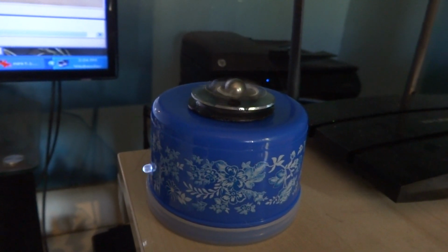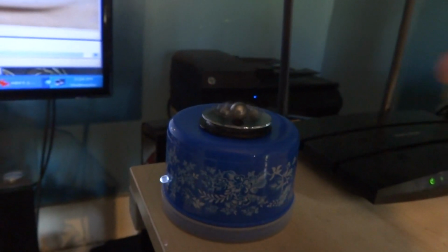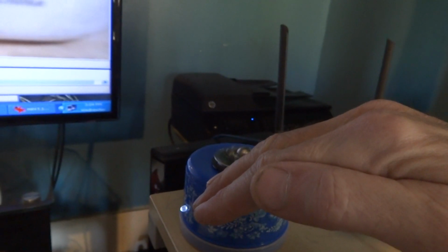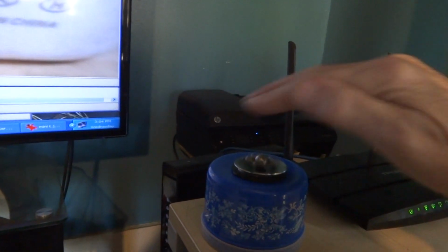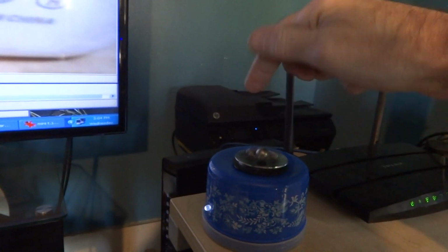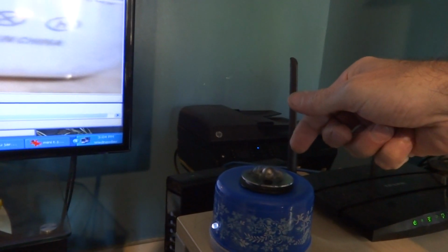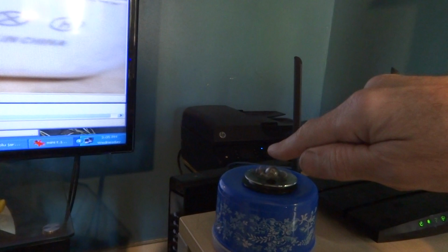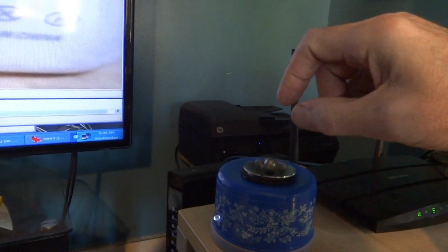And what that is, it's a 99-cent store bicycle reflector. Obviously the reflector has the curve in the wrong direction. So I had to take the mirror thing out of its holder and reverse it around, okay? To get it out of the holder, I tried prying a screwdriver underneath to pop this lens out. Broke one doing that. They're too fragile. You have to take a very small screwdriver, go around the lip, and push very hard to break the outside part of this lip. Okay.